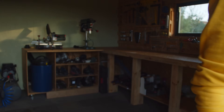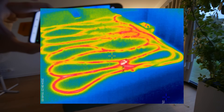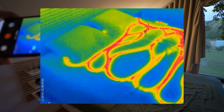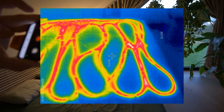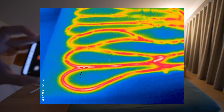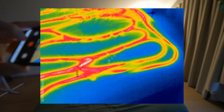I never tested my system as a heating system, so let me try it now. I swapped the cables going from the Peltier module to the relay so now we're heating the water instead of cooling it. The bed is already very hot in some places — almost 30 degrees, which is exactly what I set. Peltier modules are very inefficient at cooling but are just okay as heaters. Such a system makes sense as summer ends and winter approaches. You can of course implement an H-bridge in software so you don't have to swap the cables manually.